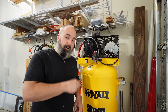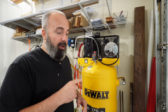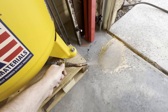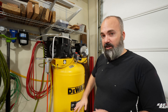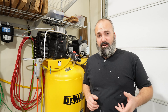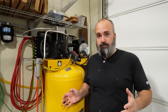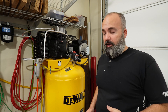I also did not drain the bottom of the tank for two weeks as an experiment. I let it sit while running this thing, and then I drained it last night. I did not get that much moisture out of the bottom of the tank. There was moisture, however — after two weeks of condensing and sitting in there, I got a bunch of rusty, semi-oily water out of the bottom. It was really easy to clean up off the floor, which tells me there's not much oil but there's a ton of rust. That tells me the inside of these tanks are not finished in any way — it's just bare steel. That is why you have to drain them either with an automatic drain or regularly drain the bottom of the tank, even if you have a cooler setup.